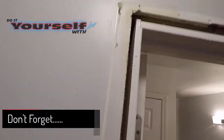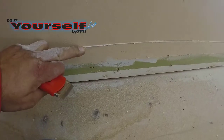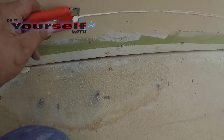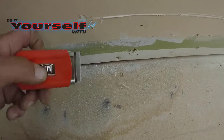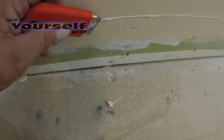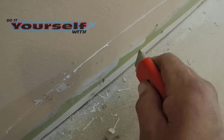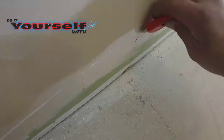The next thing I have to do is remove as much of the silicone as I can. I tried using a putty knife or a scraper and it wasn't working as well, so I used a razor blade. I'll just try and get as much off the walls as I can without doing too much damage. At this point, I thought I was going to be here forever. After I did this room, it wasn't very difficult at all, because I gave this job to my oldest son. Letting the blade down and trying to cut it off wasn't working very well, so I just stood the blade up and started scraping. It seemed to be doing a pretty good job.